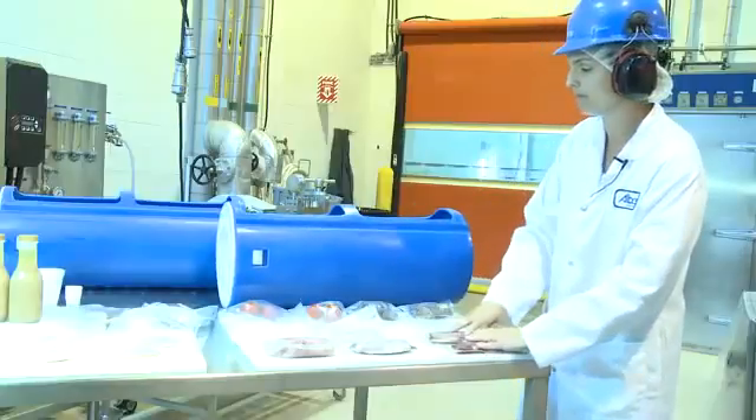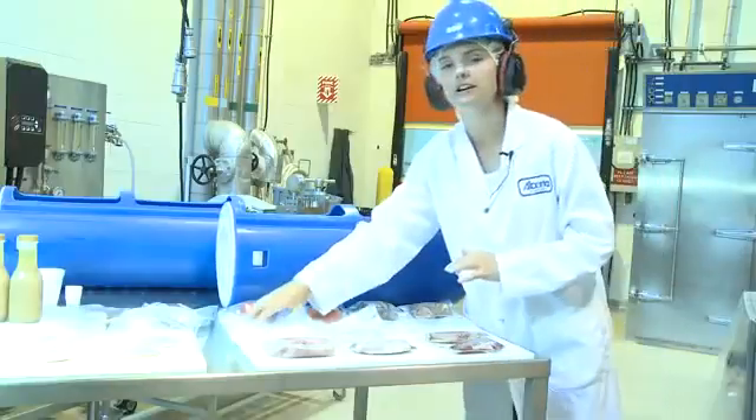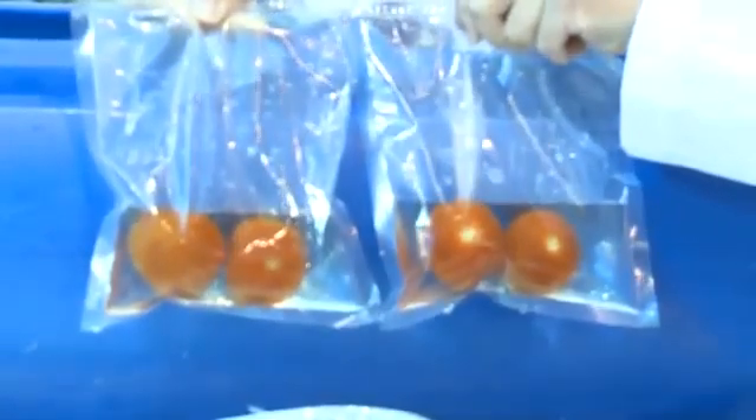As an example of fruits and vegetables, we have tomatoes here. I used two different types of packaging. The product suspended in air was an unsuccessful application of high pressure processing — the pressure was too much for the integrity of the product; the skin broke and moisture leaked from the product. However, when we suspend the product in water, the water keeps a buffer — it is able to be compressed and it allows the product integrity to be maintained throughout the processing.